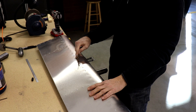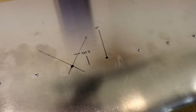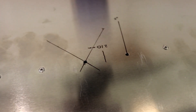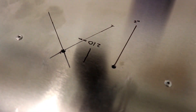I'm going to mark the other two lines on this hole and then drill the other hole on the top. So I said I was going to show you two different ways to do this. The first way is to draw an X, and where they cross you have your hole. The other way is to draw just one line — and this line is two inches long and it ends right in the center of that hole.